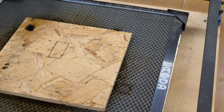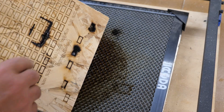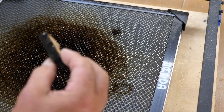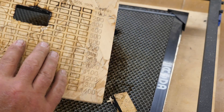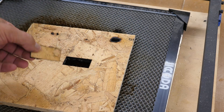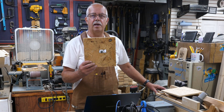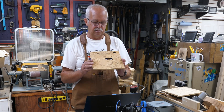So we can take a look at this — again, 100% power, 300 millimeters per minute, and 12 passes — and see if that cut through. It almost did, but not quite. As you can see on the back, it did some pretty severe scorching. I think one more pass probably would have done it. It's a good clean cut from this side, pretty nasty from that side. If the piece you're cutting out is what you wanted, you're going to have to deal with things burning in these layers. This is not the best material to be making things out of.